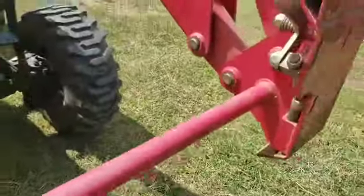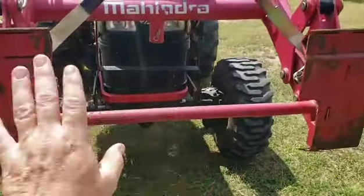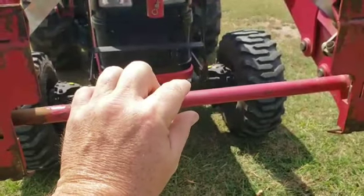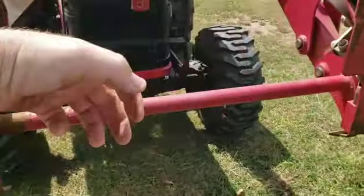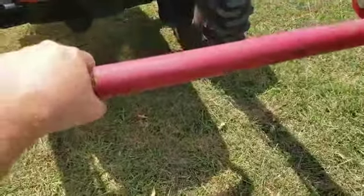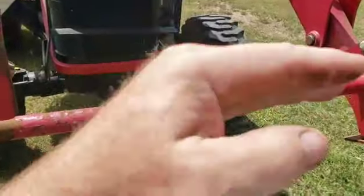And so what we're going to do is cut this support and realign these two plates, and then we'll probably cut it in the center and realign the two plates. I might end up putting it on the bucket here, and then we'll prep the cut area, weld that, and then we'll put a sleeve around it. I think this is 1 5/8, which is entirely too small for this size tractor. And then we're going to cut another pipe that has an 1 5/8 inside diameter, cut it in half and then wrap it around here and re-weld it.